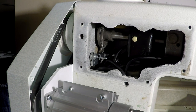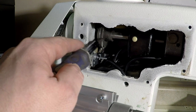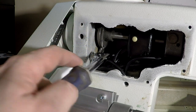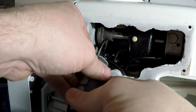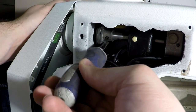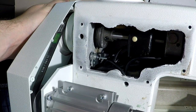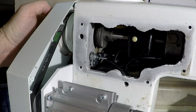In order to change this, what we do is loosen up two screws that are in this collar piece right here. That will allow us to swivel this collar piece around the shaft and put it where it needs to be. We get the screws where we can handle them and just barely loosen those up, so they're just snug and don't let the collar flop around.